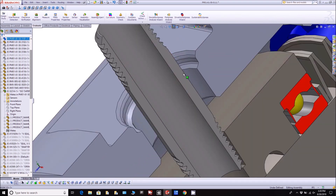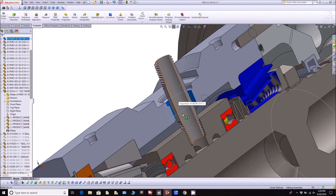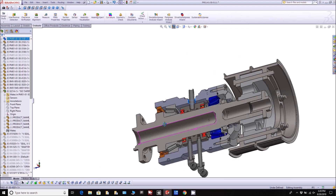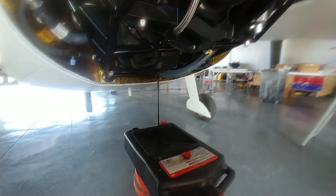This top here has to be sealed because the sump on the engine itself actually draws a slight vacuum, so I've got to make sure the redrive is sealed. I'll be doing a vacuum test on it once it's all together to make sure it can hold a vacuum — if it doesn't, it's potentially leaking in through the oil seals.